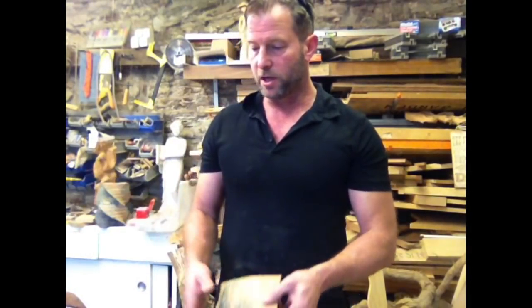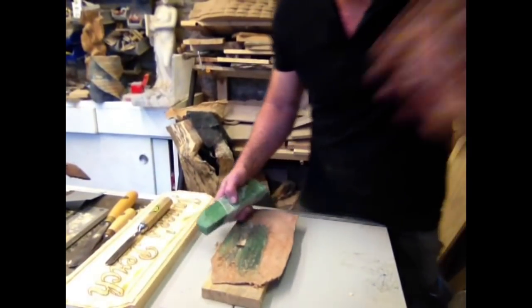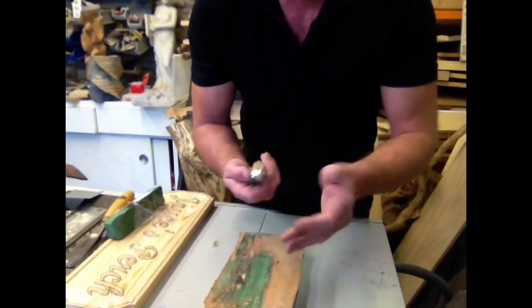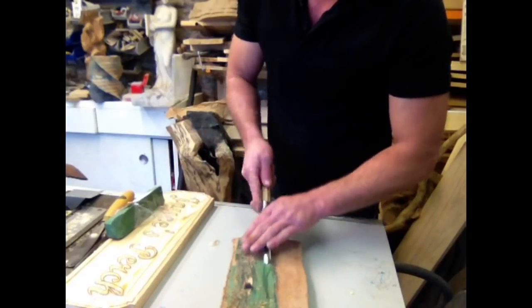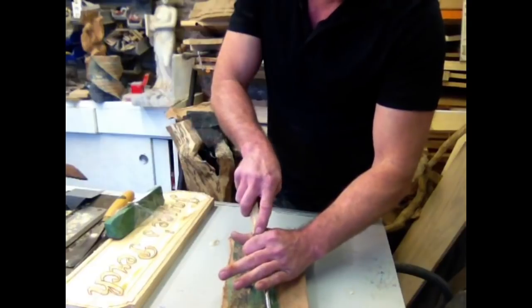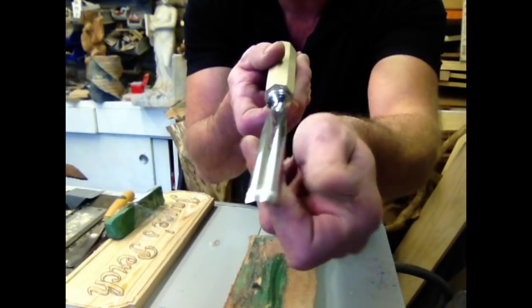I'm not using any stones or anything like that. I'm going to use a piece of cowhide stuck on a board, and some green polishing compound — I'll just rub that on there. When you're doing the gouge, you've got to do two sides: the exterior and the interior. I'll start with the exterior — just a piece of hide, rough side down, and I'm just going to drag it across. As I'm doing it, I'm rotating, and I'm never pushing, I'm only pulling. Getting the outside done with a nice polished edge.